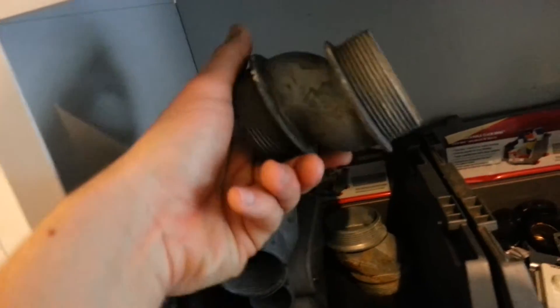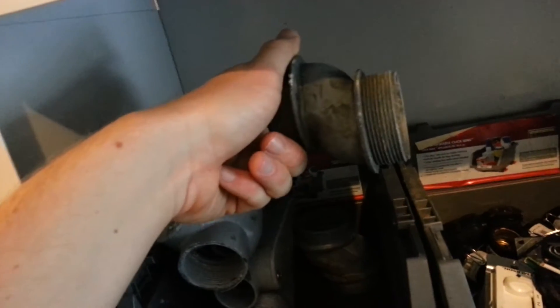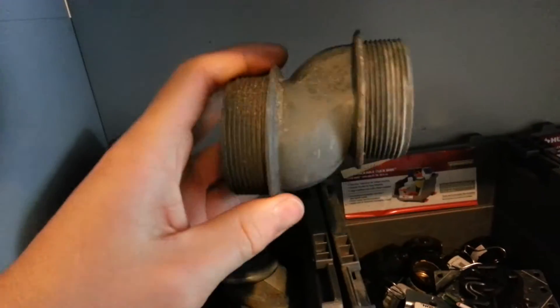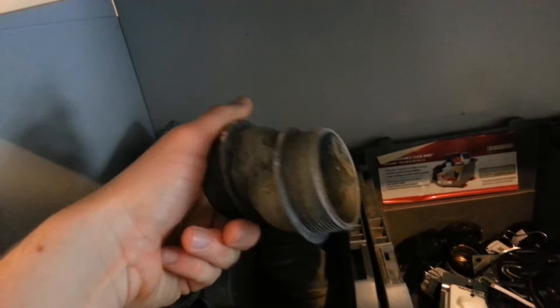This is what's known as an offset nipple. It's for service situations where you have a meter and a panel side by side and the holes are at different elevations from the back of the wall. A straight nipple wouldn't work, so this offset nipple will turn to allow you to make it work. If you're in that situation, you would have to use an offset nipple.